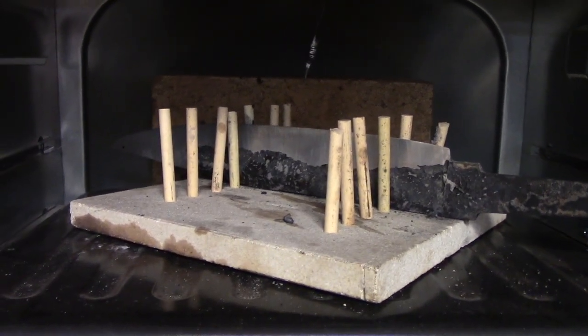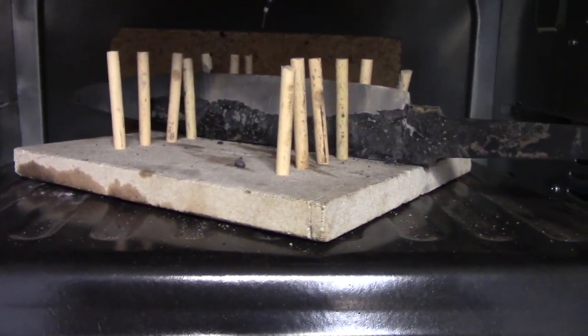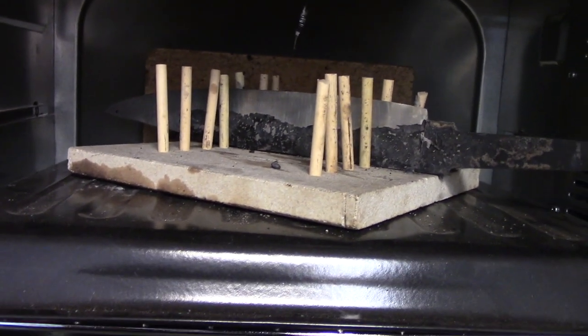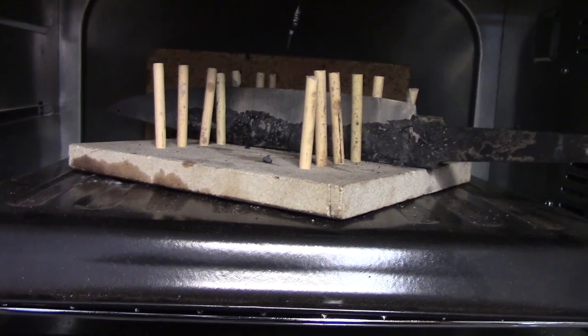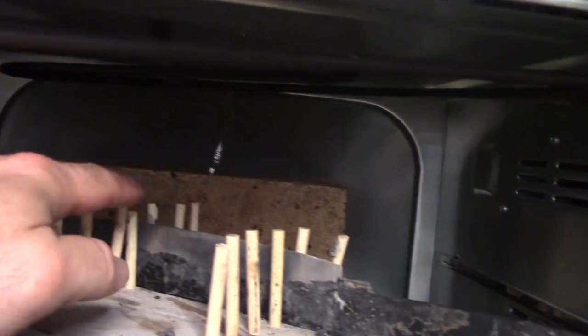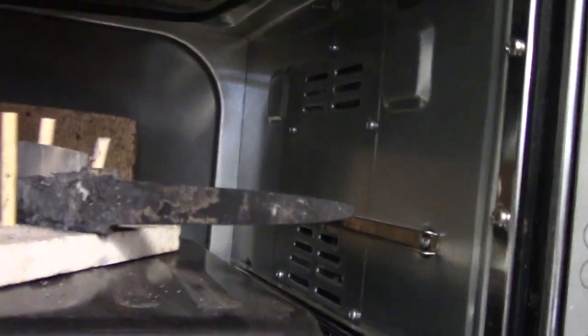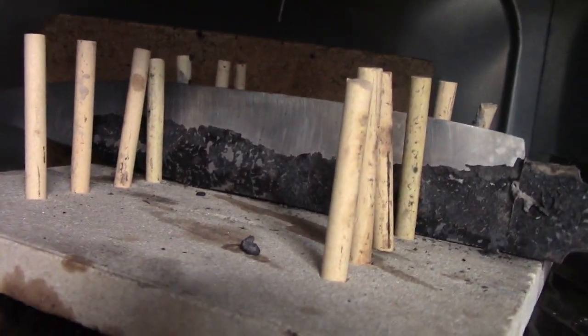So I'm going to temper this thing now in here, and what that fire brick in the back does is that it regulates the temperature inside this oven. So what happens is once this thing gets up to temperature, whenever the temperature starts to drop, then these elements here, they'll fire. Well, the problem with that is that because your blade is so close to it, it can actually overheat the air that's in here. Now, the probe for the computer is over in this area, and it doesn't necessarily read as accurately. If you see it, it's up there in that corner. Well, it may only be 420 degrees up there, but right here in the area around those elements, it may actually be a lot higher, and you'll actually over-temper your blade, not realizing it.